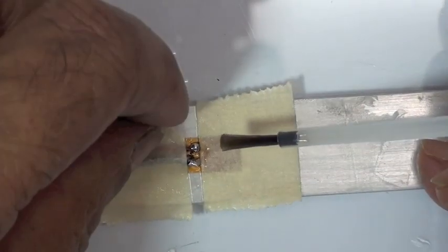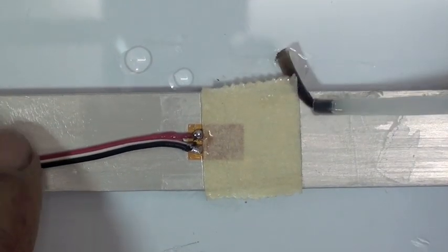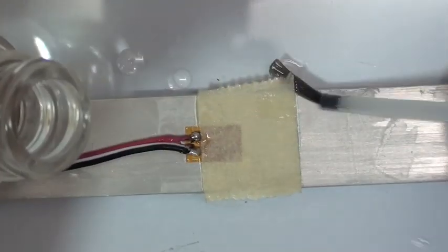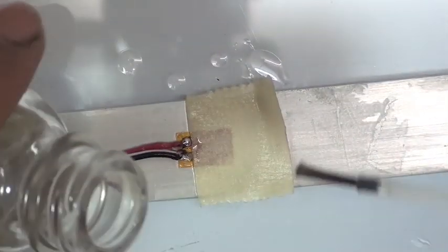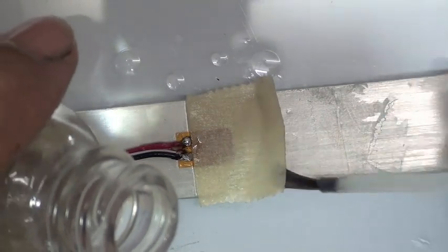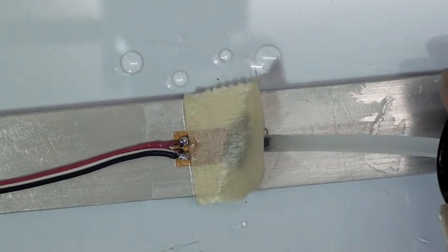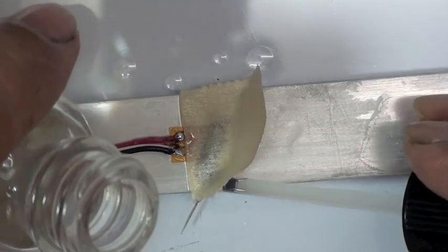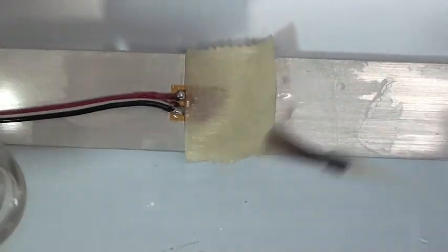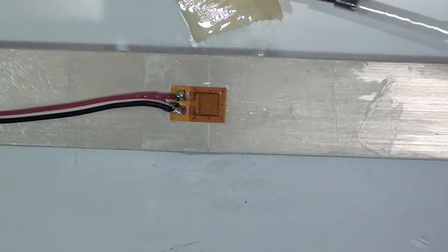Insulation resistance is the resistance from the lead wire system to the aluminum, the conductor. We want to see at least 10,000 megaohms there. Aside from not having a good solder connection, or the solder touching the aluminum, which is another problem, the one material that will cause that insulation resistance to be low is the flux. It's electrically conductive, and in fact, the insulation resistance check is a test to make sure that we've removed it all effectively.